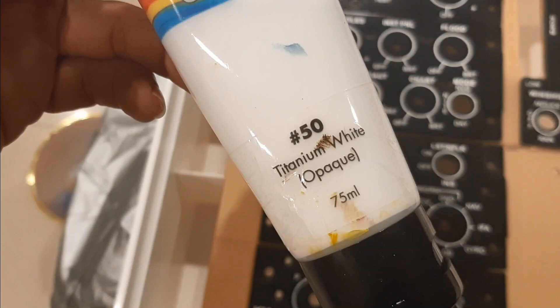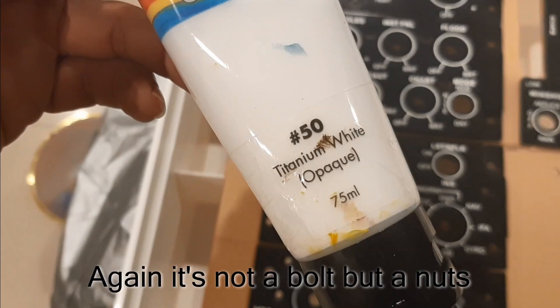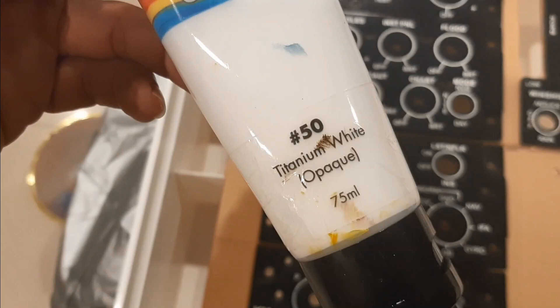Unfortunately, adding the acrylic paint into the recessed lines turned out not to be a good idea, because the LED backlighting I prepared in the base panel wouldn't shine through effectively — it was too thick, creating a faded color rather than a clean backlight. Other builders just engrave without filling with white opaque acrylic. That was a mistake in this build, so at the end I'm not using the backlight for the switches and lettering, which is quite unfortunate.